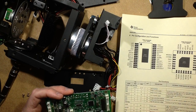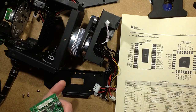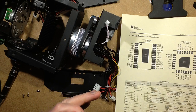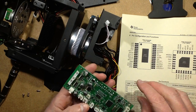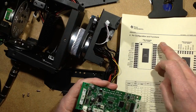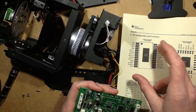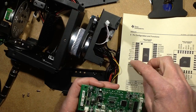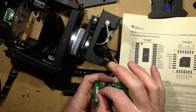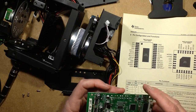A little update, because I did a little bit of detective work. I thought, what's the most common step motor chips that would be used in things like Arduino type stuff and, you know, things like 3D printers? So I just looked for common chips, and I thought that the common pins at the end were a common ground, but though it is ground, it's actually mode setting pins. But I found this 28 pin chip, and the pinout roughly matched this, so I printed off this datasheet and then probed it out, and it does appear to be a DRV8824 by Texas Instruments.